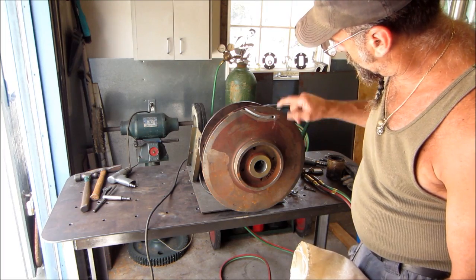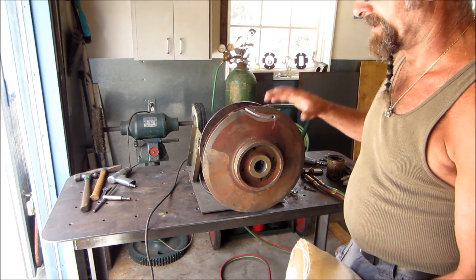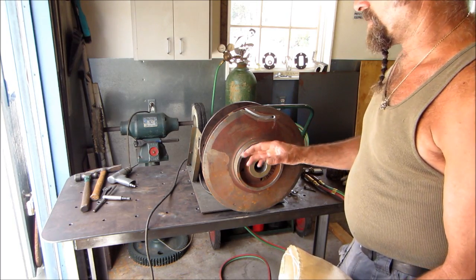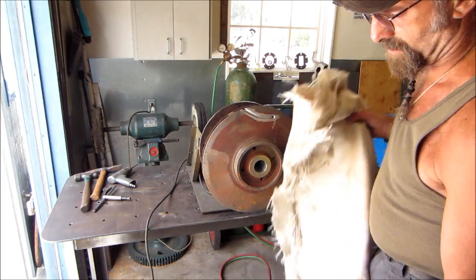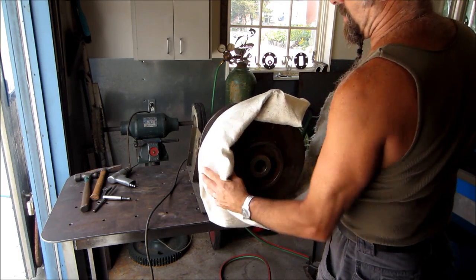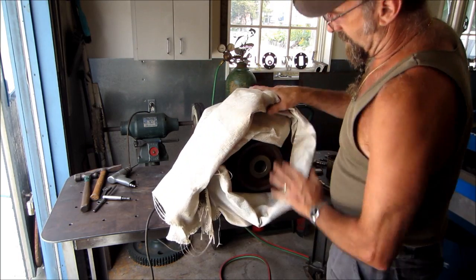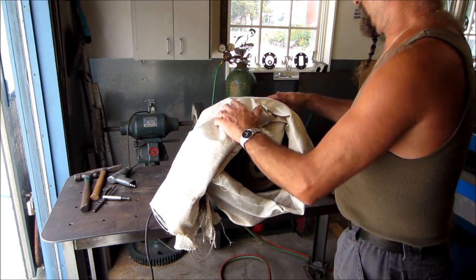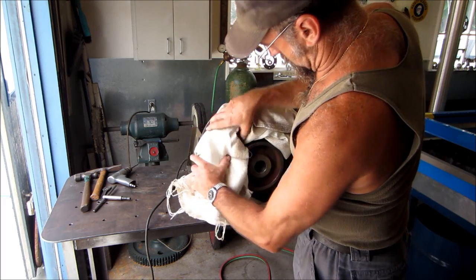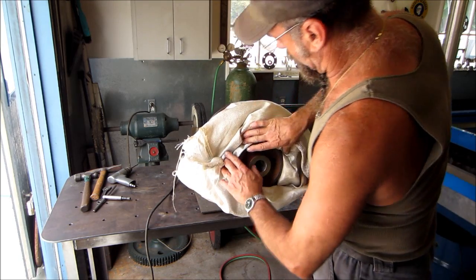We got a hole down here so it won't travel any farther in here, but we're gonna blanket this thing all the way around the outside. And the reason why we do that is because we're gonna warm this up and create the brazing temperature we want, and we don't want the heat to dissipate and just venture on up. So we're going ahead and we're wrapping our opening all the way up here. All right, we'll go ahead and get some wire on here.